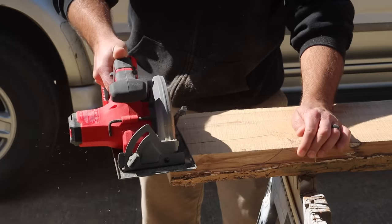After I cleaned up the slab and removed all the little areas of puddled epoxy, I noticed a crack on one end of the slab that I thought would look cool with a bow tie. I had previously cut out some bow ties on my X-Carve from a piece of Paperstone countertop that I used in my outdoor kitchen. I just had to cut it down to a size that would look good in that area. I got my trim router out and routed out the area, then used a mallet and chisel to clean things up.